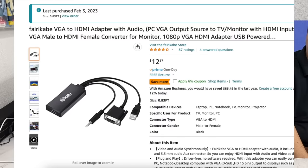Okay, now we're just going to answer some of the questions that people always ask about hardware decisions that were made on the X16. And we'll start with one of the questions that people ask a lot, which is why not use HDMI? And actually, the answer to that is more complicated because we can use HDMI. In fact, I've actually shown this working before just using one of those little $12 adapters that you get on Amazon that can convert VGA to HDMI, and they work perfectly fine.